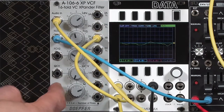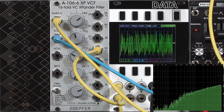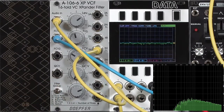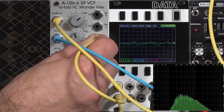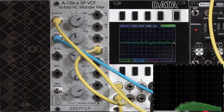To get a better idea of what's going on, I'm going to switch to the left filter group, go to the 3H three-pole high-pass, and look at that graph and listen to it. Very bright sound cutting off the low frequencies. When I switch to the right side, an additional one-pole low-pass filter has been applied to cut off some of the high frequencies as well. So the 3H1L version is going to have a little bit brighter of a tone than, say, the 4B setting. More high frequencies are attenuated in 4B because it's using two poles for low-pass compared to one pole.